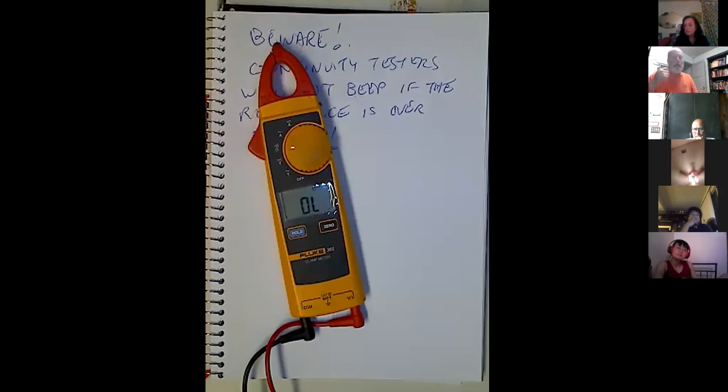When you're a professional mechanic you've got to do stuff quick. If the battery is good but there's no current flow, you know to look elsewhere — like the socket, connectors, or switch. But test the bulb really quick because that's such a common cause of failure. It's all a process of elimination: you've got a circuit and you start testing each part as fast as you can.